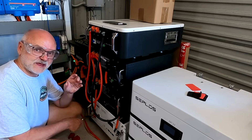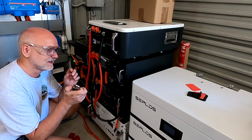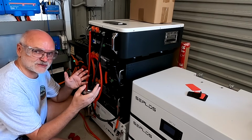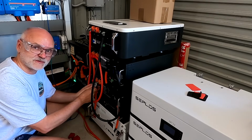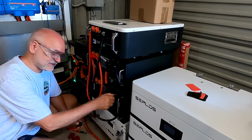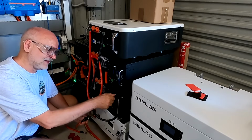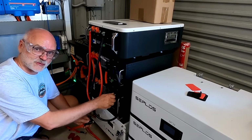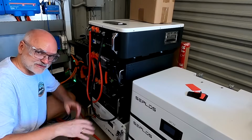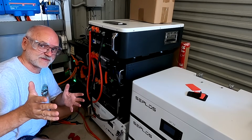And you can imagine, if the battery cells have the same charge and discharge curves, or almost the same, and you put these cells into one battery bank, they charge and discharge very uniform, very consistent. So the battery cells which are more consistent make it into the premium battery boxes. And the ones which are charging and discharging not so consistent are coming into the basic battery box. This is how they distinguish the basic, standard and premium batteries.